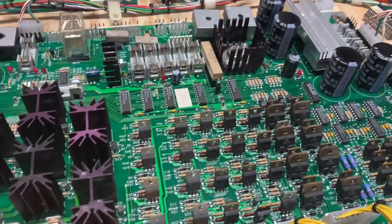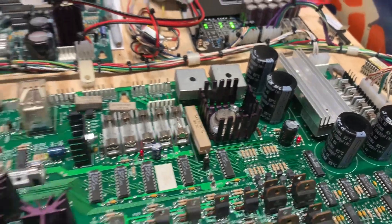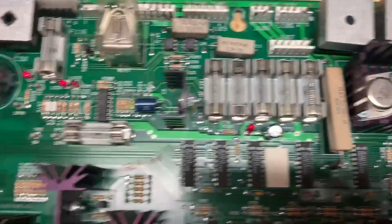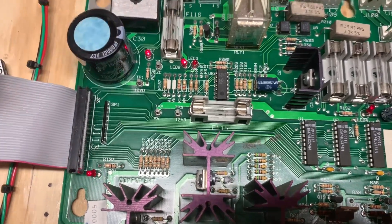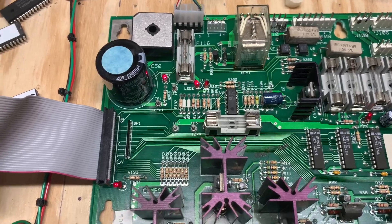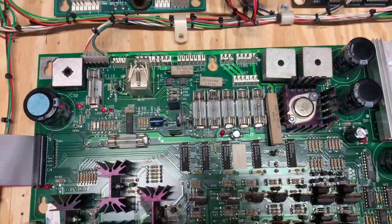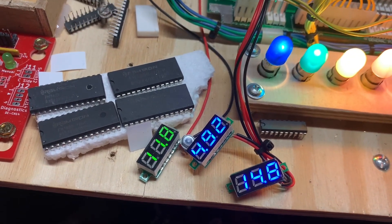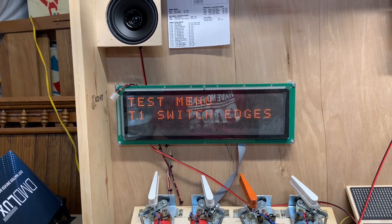Here is the power driver board that had the ripped through hole at C5 — I have repaired that. We have it on the bench now to complete our testing. You can see we've got two LEDs lit in the center and these two on the left also lit. These two are line level voltage detection LEDs and are pretty much meaningless. What you need to have is the five LEDs that form a bow tie lit on the power driver board. It's delivering about 4.92 volts — really about 4.96 because that voltmeter is not very good.